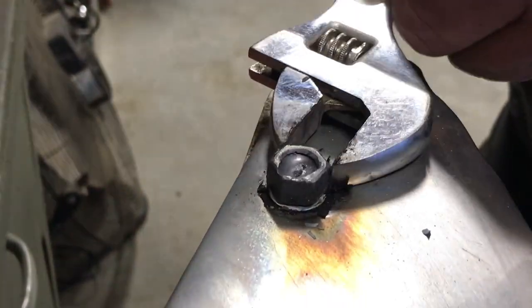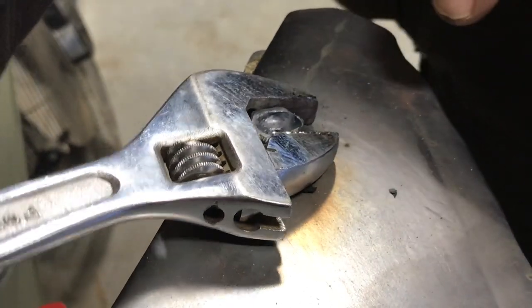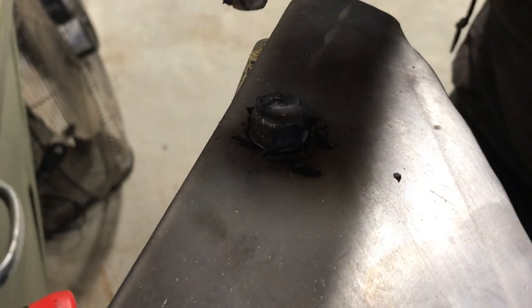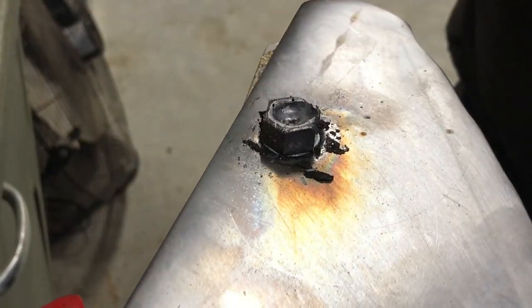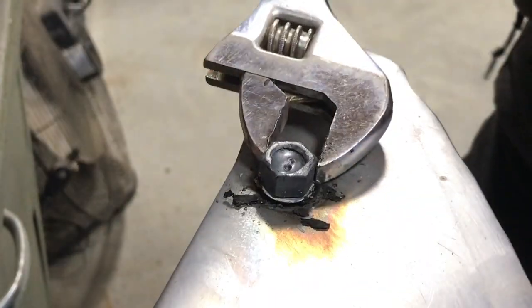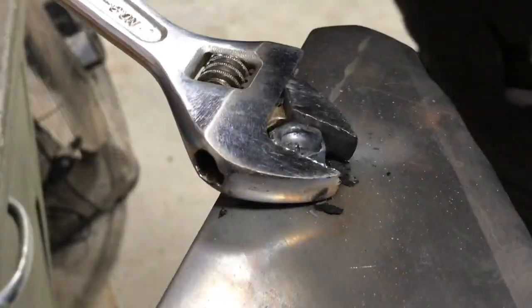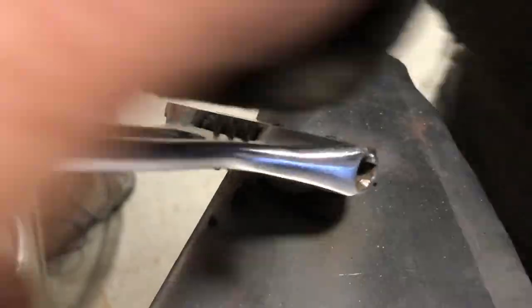The heat helps too, eh? Oh, immensely. But this heat is working the other way. This heat is making this get bigger in the hole. If you were to make it help, you'd warm this up and make the hole bigger. And keep this cold. So it's doing actually opposite? Yeah. I thought the heat was helping because it was burning off the Loctite. Yeah. And that's how you burn off Loctite. There's Loctite in there? Well, I thought there was. Because I couldn't budge it.